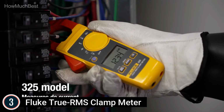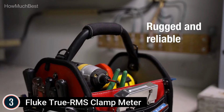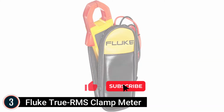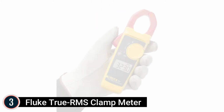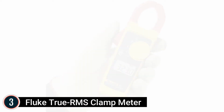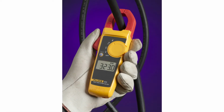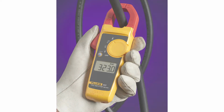Meets IEC safety standard 61010-1 and is rated for CAT IV installations to 300 volts and CAT III installations to 600 volts. The Fluke 323 clamp meter is a troubleshooting tool for commercial and residential electricians. It includes true RMS measurements, enhanced comfort ergonomics, and a large display for efficient troubleshooting. Use it to verify the presence of load current, AC voltage, and continuity of circuits, switches, fuses and contacts.